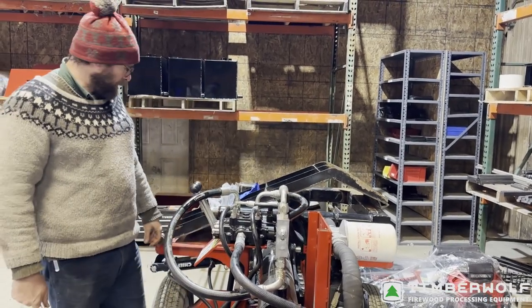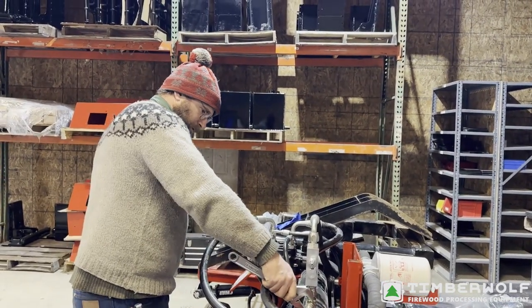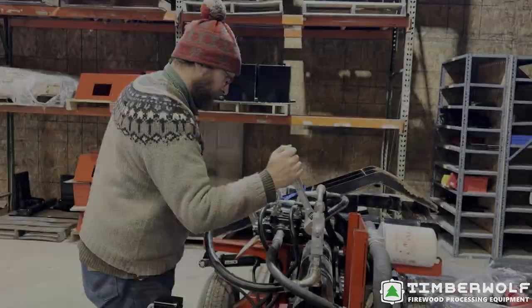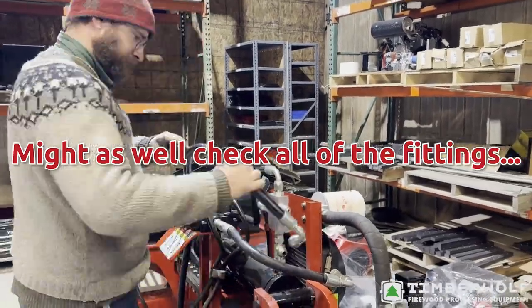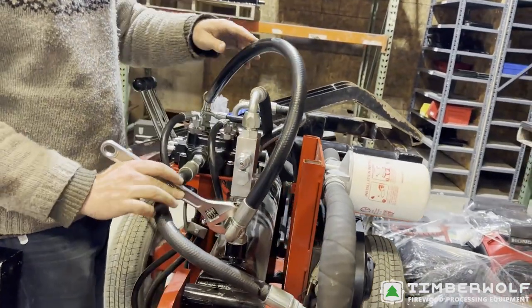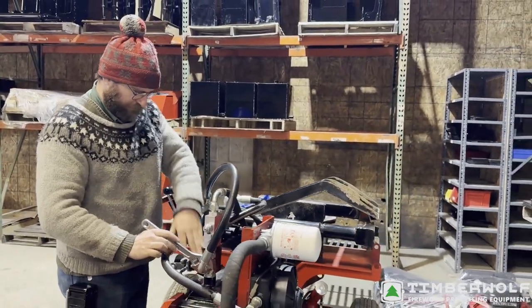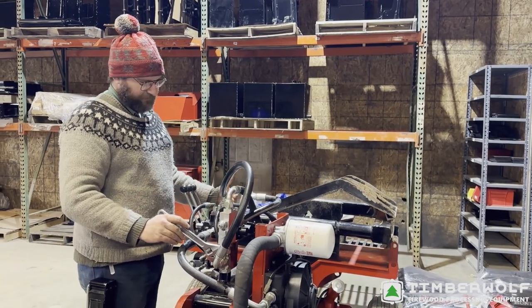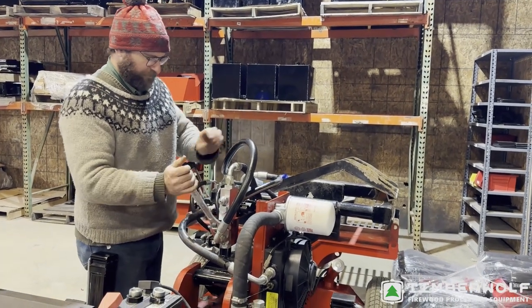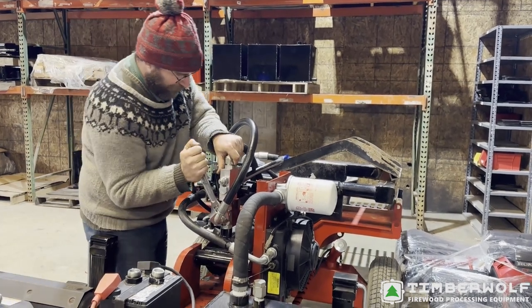Alright, as long as I haven't omitted anything — I'm tight-wise — just check, we should be good to go. Good thing I checked, that wasn't tight. Now some guys say why don't you just build the regen right through the valve. Well one of the big advantages here is the regen happens right here, real close to the cylinder, so you don't get a lot of line loss. If you're setting it back at the valve, your fast flow is going through just that line alone, but by doing it this way it dumps right into the cylinder — a little extra cost, but you'll gain a little more speed from reduced friction line loss.